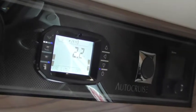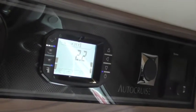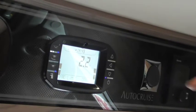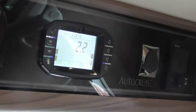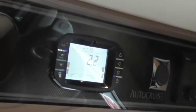If you've got it in storage and just switch your tank heaters on, it's not going to protect your system. So it's still got to drain down. You've still got to drain down as you would have done before. Always drain down, especially over a period of time. If you're not using it and it's cold, get the water out of it.